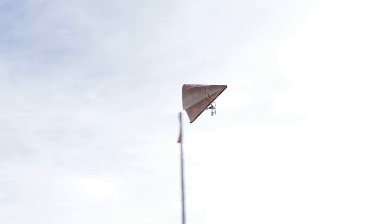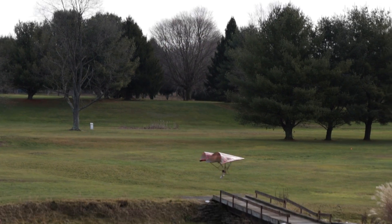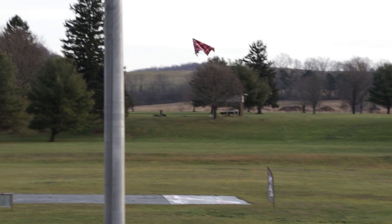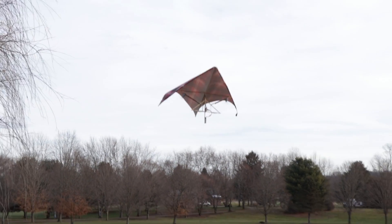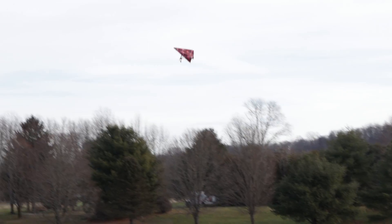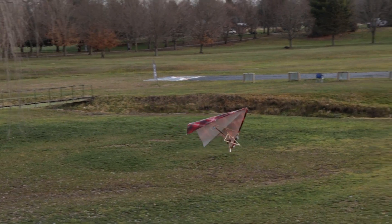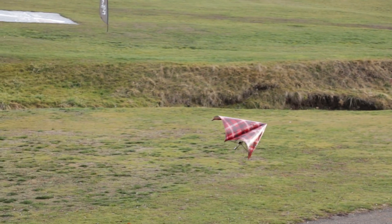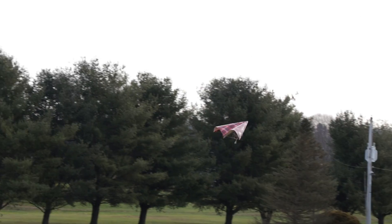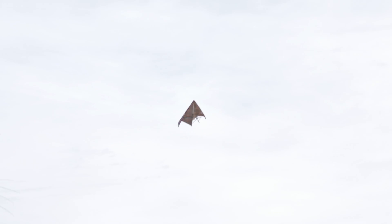This is the experience I wanted and was hoping we'd have. The thrust simply gives us the ability to climb or to dive, and we're using the differential to turn left and right. As far as maneuverability it's doing fantastic. Moving the motor and the battery further back gave us the center of gravity and lowered the center of mass, so instead of worrying about it not self-correcting, it's super stable — glides great, turns great, climbs easy. I'm only flying around half throttle; it has plenty of power to do what I need. This is going to fly for about eight minutes. I'm really surprised how well it's doing in the wind — it's not the calmest day, but it's handling the wind really well. Even if it flips over it self-corrects quickly. This is definitely a crazy project — I'm going to be including the plans and I want to encourage you guys to dream up something crazy, look at odd materials, and put them to flight.